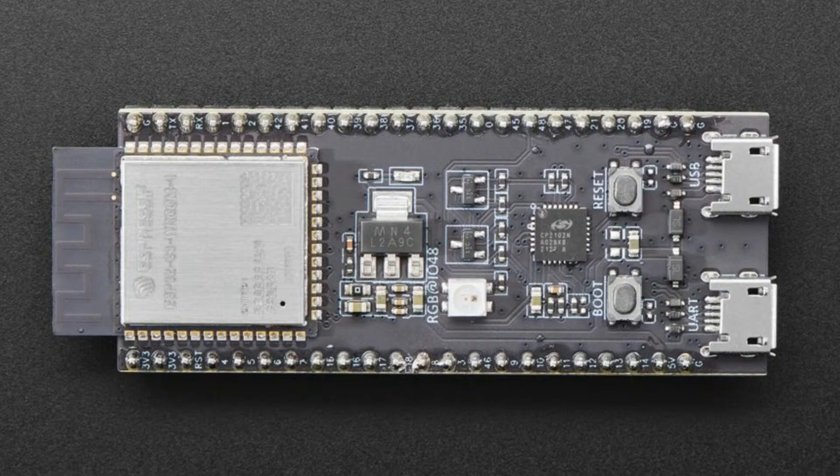The S3 is a very new chip as of this video — it's only supported by the Espressif IDF right now. It's not yet supported by Arduino, although I do see they're doing commits — it's coming. Hopefully if this is two months after this video is out, it should have Arduino support. MicroPython also has some preliminary support for the S3, and of course CircuitPython — we're also working on the S3. Having these dev boards out there is going to really help, because before this you could only get raw chip samples and people didn't want to solder them. So there are three versions.